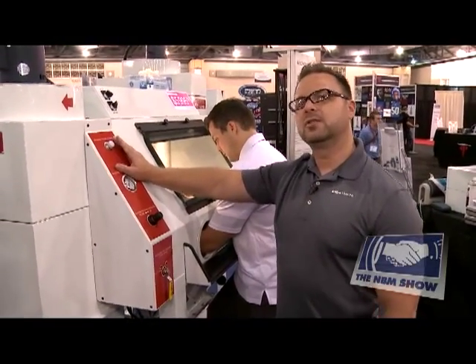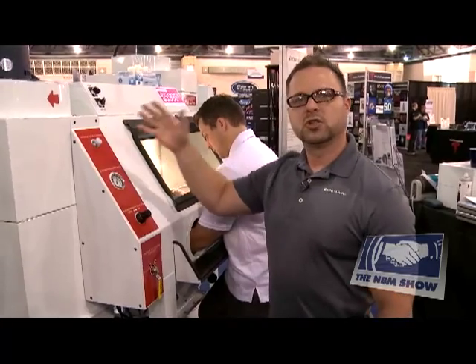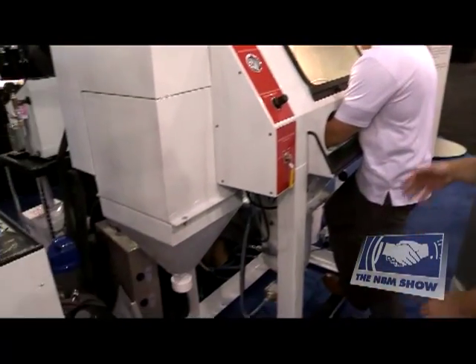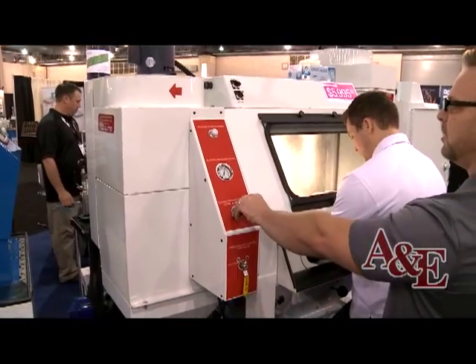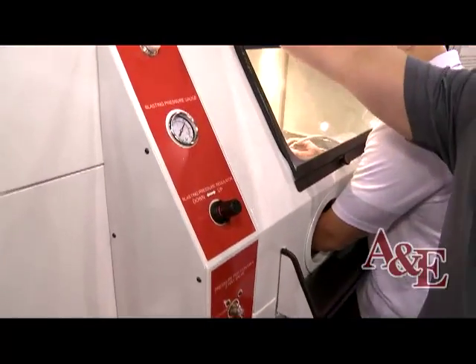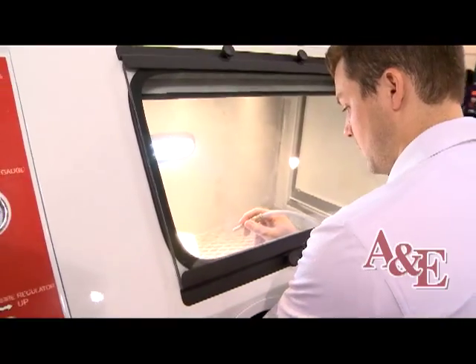With pneumatic reverse pulse, it's automated. You don't have to push a button on the back or shake a handle — you just hit the button and it shoots compressed air at the filter. All of our controls are ergonomic, so not only is our sand carver clean, but it's ergonomic. Everything is at eye level. You can turn the pressure up and down while you're sandblasting, turn it on and off, and we even have an LED light for inspecting crystal through the back so you can make sure you've sand carved as deep as you want.